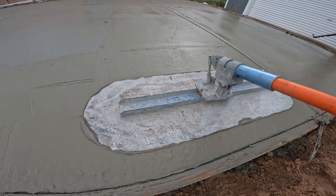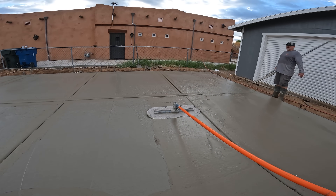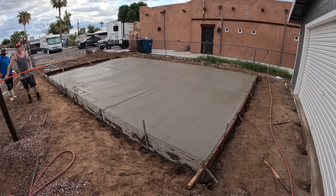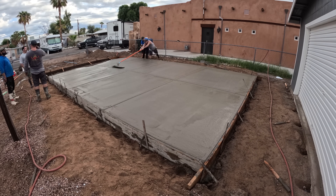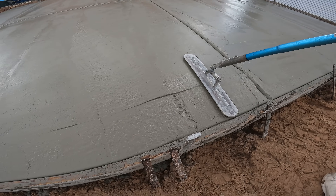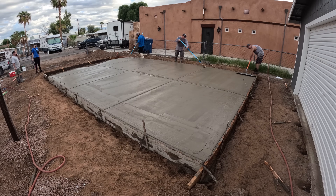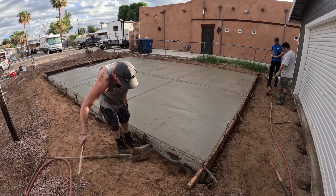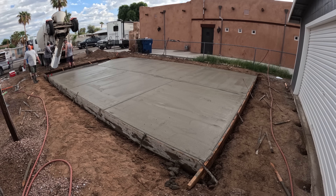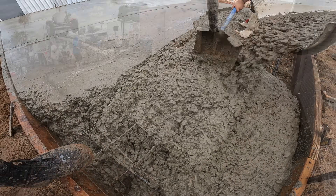Here's the Fresno going on. We've got 18 feet across, so we've got a nine-foot section — nine-by-sevens is what each one of these squares is going to be. It took about 45 minutes before we got our cleanup load, but I was keeping that edge — that cold joint — wet with the water hose and moving it around a little now and then so we could get a good tie-in. We were able to mash that together pretty good, as if it was poured all at one time.